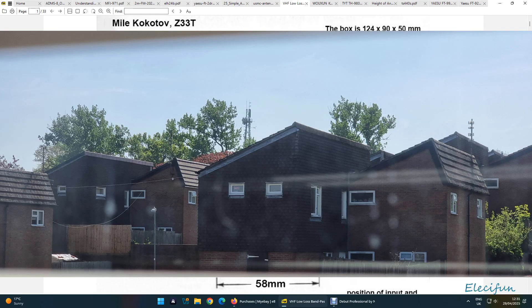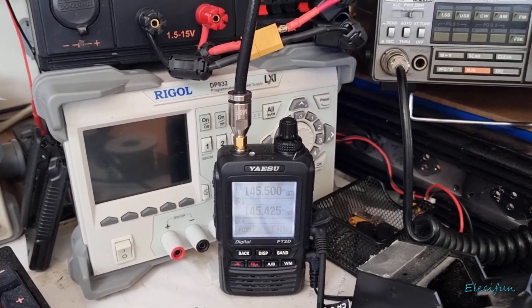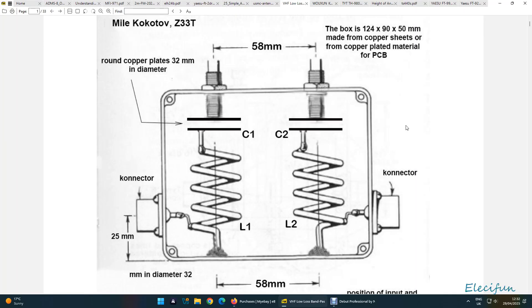In the photo you can see in the background there's a transmitter, a big tower. There are two of them, and between the two of them they make my life a bit of a misery on two meters. If I don't attenuate and block out a lot of their signals, it just overdrives the front end of my little radio. My little Yaesu has an attenuator — it does help, it doesn't eliminate altogether — but weaker signals get squashed out by the front end being overloaded.